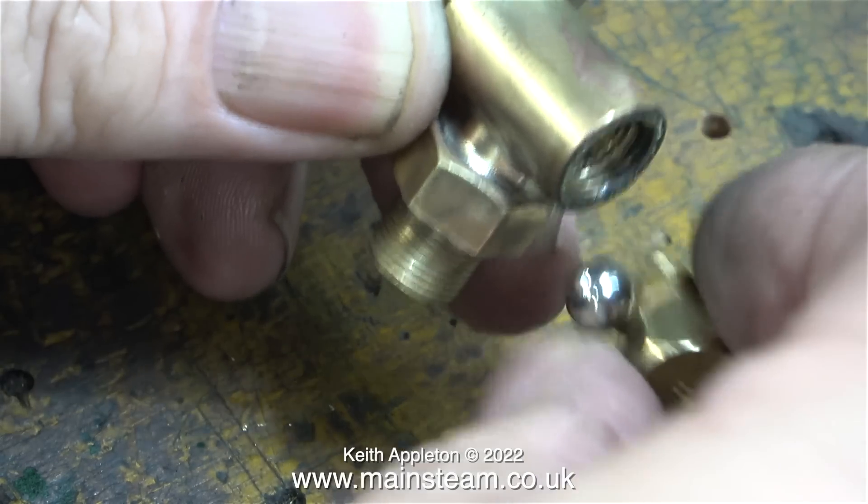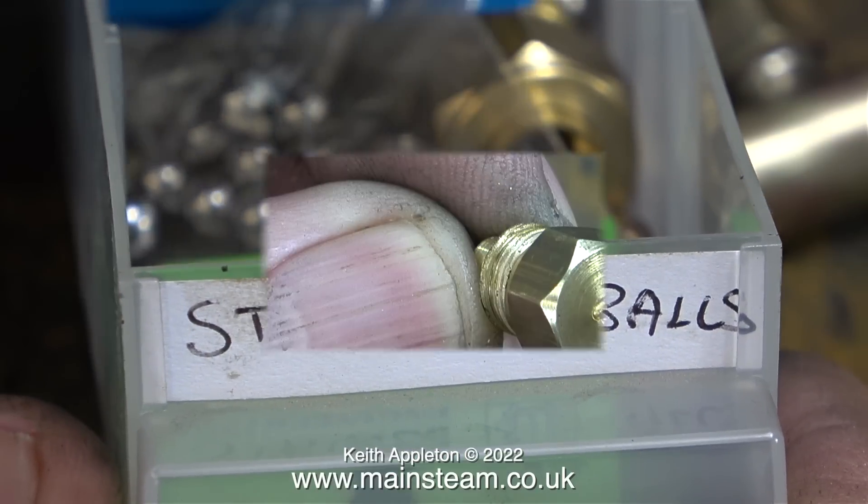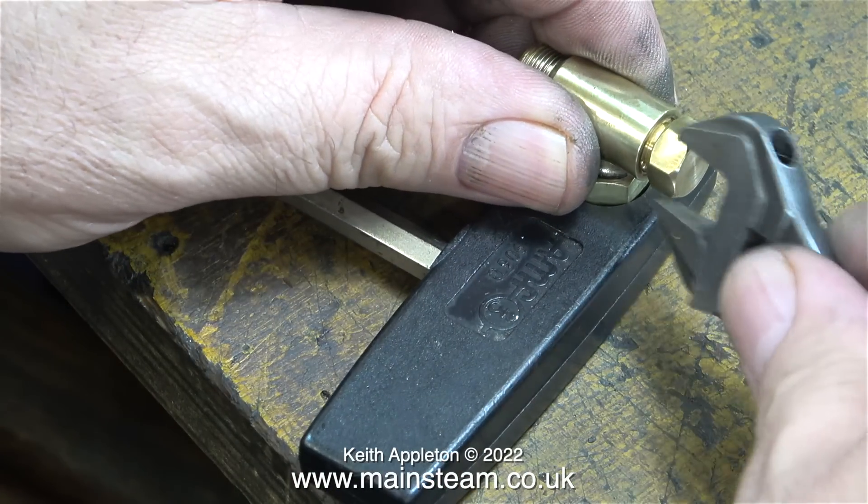What I'm doing here is removing the ball from the check valve, because a check valve on an exhaust is not a good idea. After doing this I put the stainless steel ball in my small plastic box with many others. If you use check valves made by Chris English, generally speaking they have a 'C' stamped in the top. I think the letter C is Chris's initial, not short for 'check valve' — I believe it's because Chris English once shared a workshop with his father Don and brother David, and the stamped initial was to show whose parts were whose. I fitted this top cap in my lathe and removed the letter C.